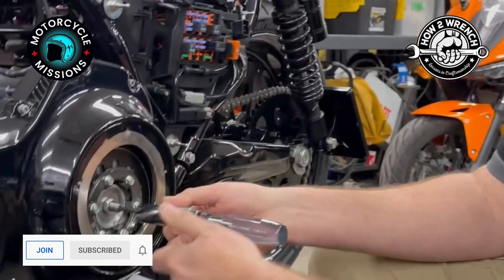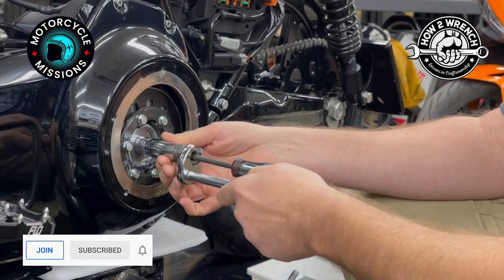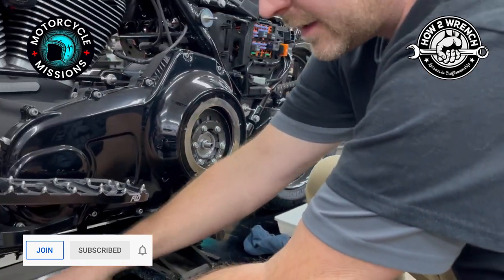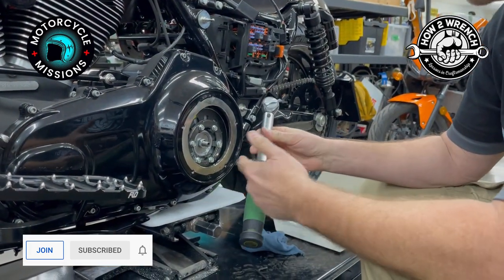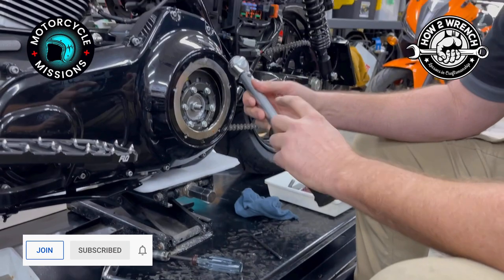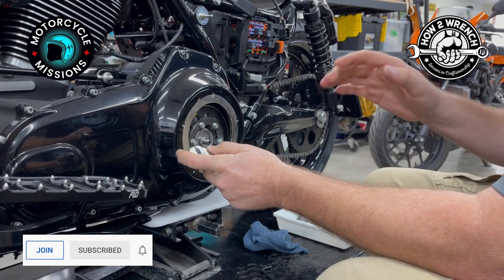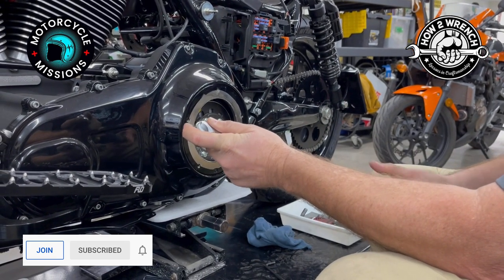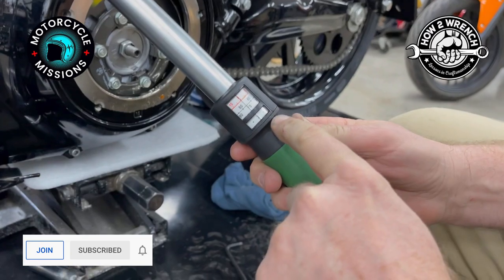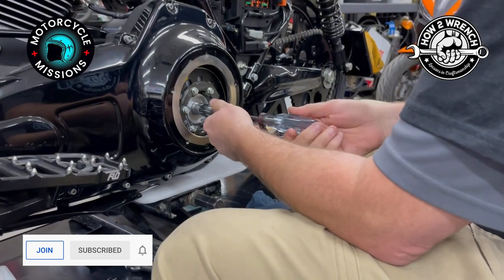What we want to do is torque this, but the problem is if I just try and put a regular wrench on here, I'm not able to torque it and I'd have to go by feel. So I'm going to grab the new torque wrench we're playing around with in the shop. We're trying to get a lot of experience on these eTorque brand torque wrenches. I'm loving the feel of these. I like to always start at the bottom of the scale — we're at 50, here's 72. Since we have 72 to 120, I'm going to torque it at that.